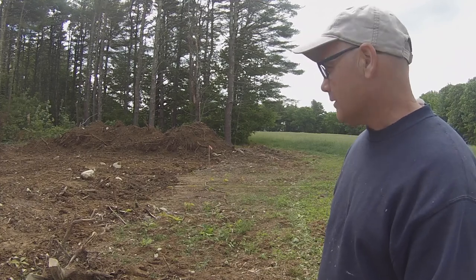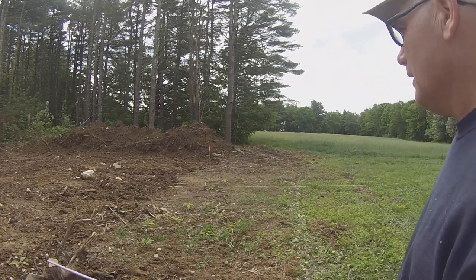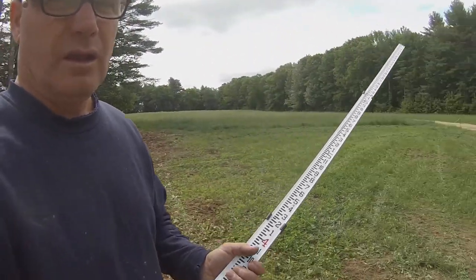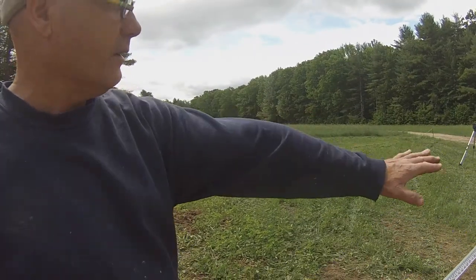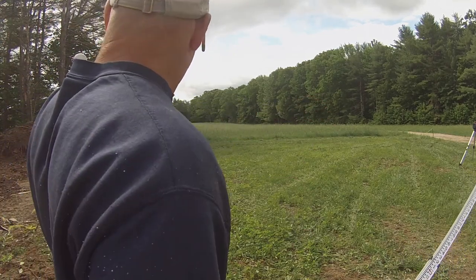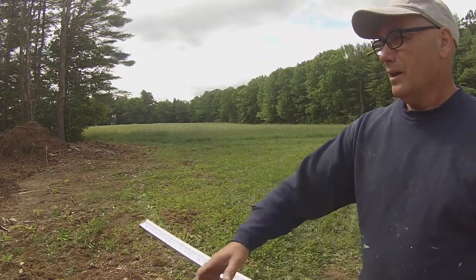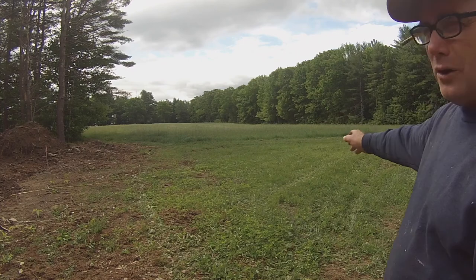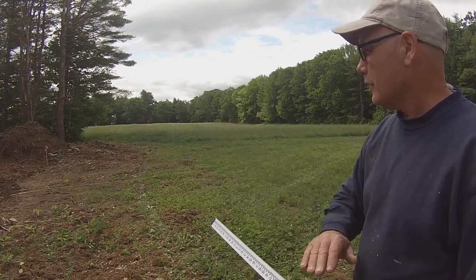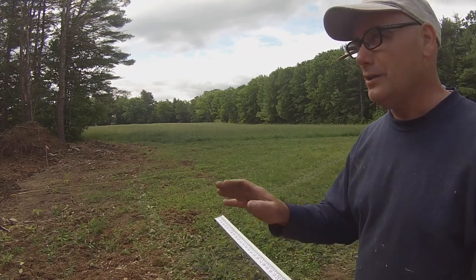So that's my plan, to get the excavator, set up the laser and dig a trench across here at 30 inches down. That's going to give me the benchmark, and then I'll be able to strip this topsoil in here. I'm going to pile it over here, and then I'm not sure how I'm going to do it, but I'm going to dig from the 30 inch down mark to the bottom of that stake and pile all of that material up here somewhere, and then try to grade this out with the tractor or the excavator somehow. And then once it's all graded back down, I'm going to cover it with 4 inches of topsoil, and that section will be done, and then I'll be ready to dig the foundation.